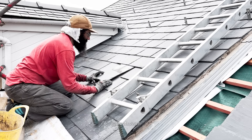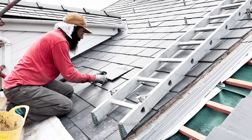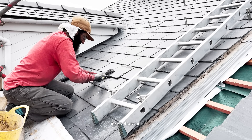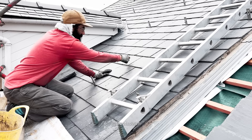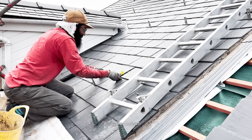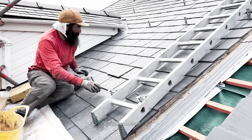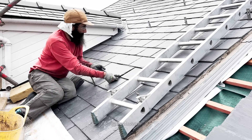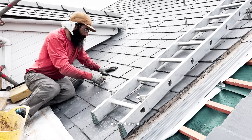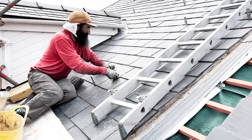I'm buying a rail system — I got the panels for £65 plus VAT, that's five panels. I'd just as well spend that bit of money and have my roof and house looking good. Here's the trickiest bit of this job — fitting this last slate. The distance it won't go in is half the width of a batten. That slate at the top, two rows up, should be resting on a batten and you've got to kind of hook it sideways to get it onto that batten. That's tricky — I think I get the hammer out again.